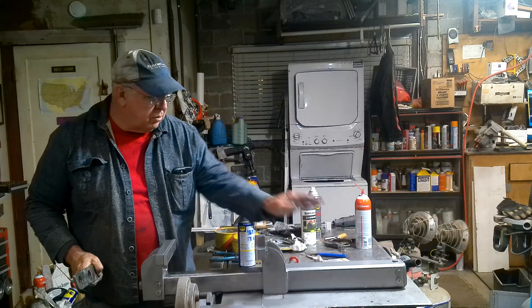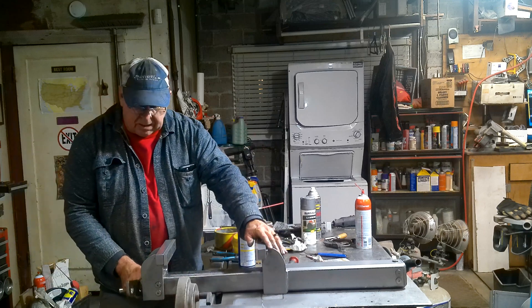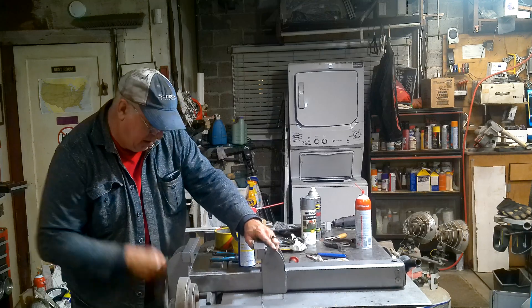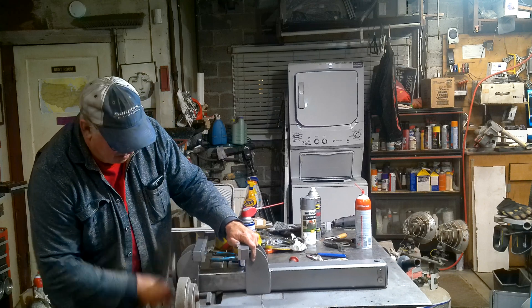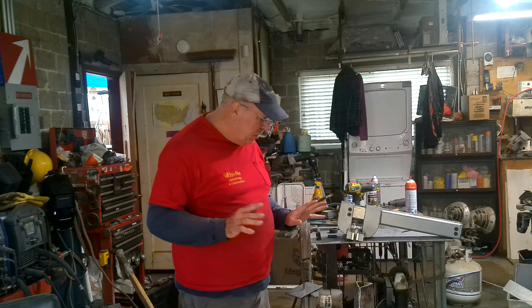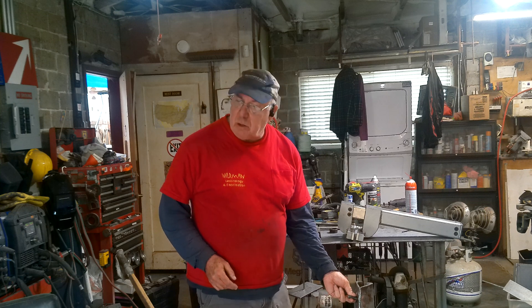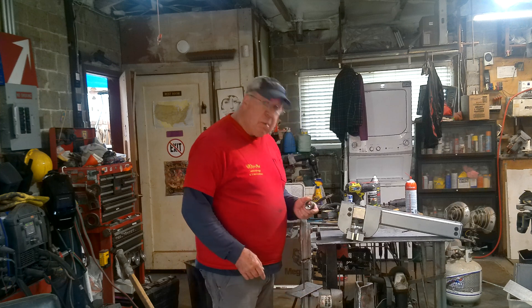If this is really going to be the last time I assemble it, I better wax that. I thought about welding an anvil plate on there and I may do that later, but for right now I just want to get my vise back. At 16 threads per inch, that screw is 20 inches long — that's 320 turns to close the vise, but it's going to deliver a lot of force. I want to put a couple of steel pegs on here: one to hang a crescent wrench, another to hang a hacksaw, and a loop to mount my hammer.